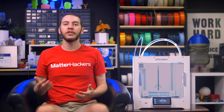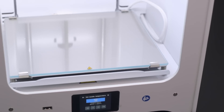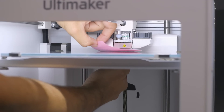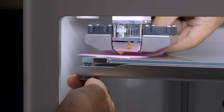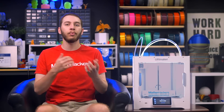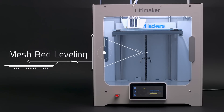For any 3D printer, having a build surface as flat as possible is essential for consistently smooth first layers. By using float glass, a specific type of glass designed to be very flat, in every Ultimaker 3D printer, you can be confident that the first layer will be flat. Among the three Ultimaker models, each uses a three-point leveling system to adjust the plane the bed sits in — tighten or loosen each thumb screw under the bed, and the entire build plate tilts to more closely match the plane the nozzle moves in. However, the Ultimaker S3 and S5 take it a step further and utilize a sensor built into the bed and printhead to gauge the true shape of the glass, creating a mesh to automatically fine-tune the nozzle's distance from the glass plate, thereby ensuring you don't have any areas of the build plate that introduce adhesion problems.